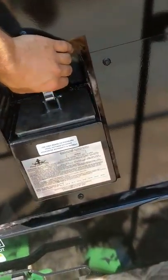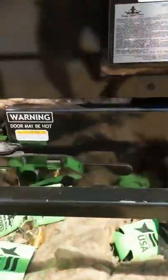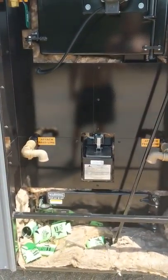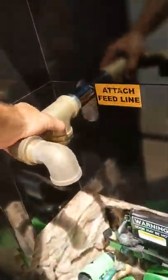Simple air combustion box, solenoid driven — this is where your primary and secondary air comes in. Down here you also have a rear hatch that goes right underneath the heat exchange tubes for clean-out. You've got two one-and-a-quarter-inch supply and return ports, top and bottom. I'm going to be hooking in three sets of lines, so I've started to build a manifold for my line sets.